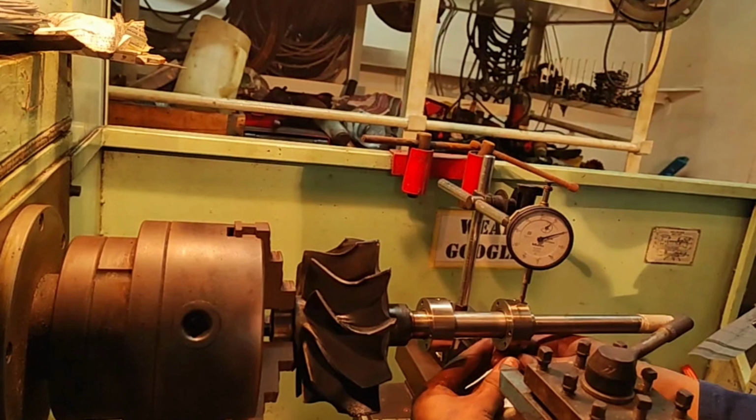Stop using the radial turbine blade if there is excessive contact of the radial turbine blade tip lines and dents due to collision of foreign substance with the radial turbine blade.